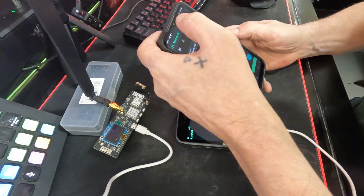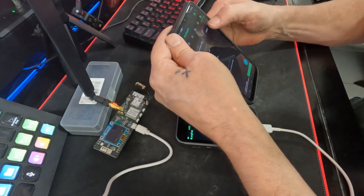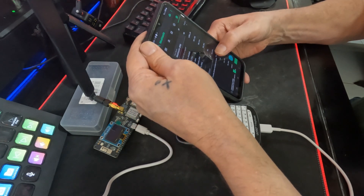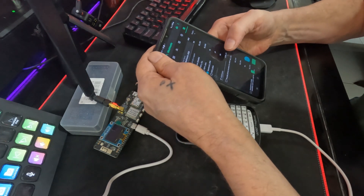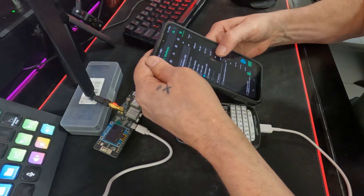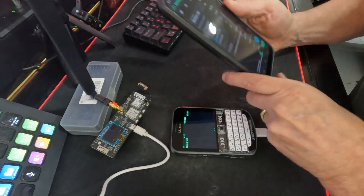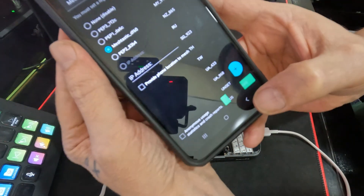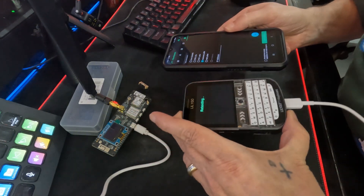Now it's interesting — it does see some of the chats. If I go in and configure this, the region says 'unset' — that might have been my problem. I'm going to set my region. I need to scroll up and down to find US, since that's what I set the other ones to. I was worried they sent me the wrong megahertz version, but it was just hidden at the bottom. I selected US and it is now rebooting.